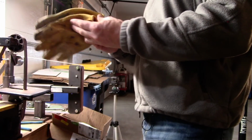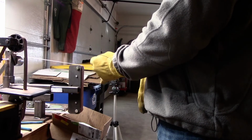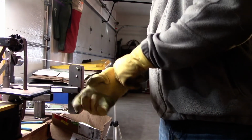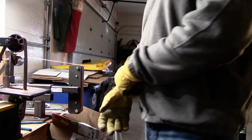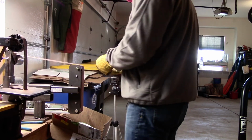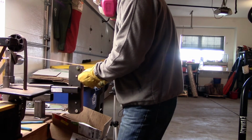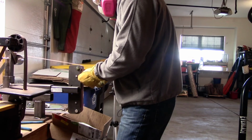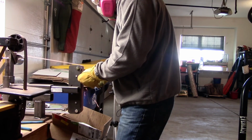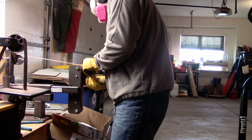So we completed that slot. Now we have to fit the high carbon steel. This is the same kind of steel we use for the scout knife. In this case, I just have to file down or grind down the back end of it so that it fits into that slot we made on the Tomahawk. You'll see that we keep checking the fit with the Tomahawk piece just to make sure that that high carbon steel is as good and close a fit as we can get.